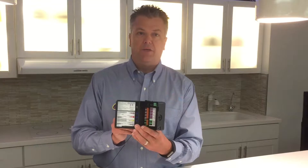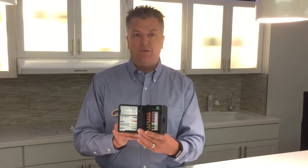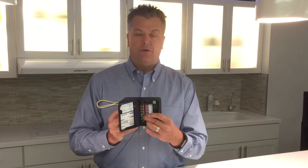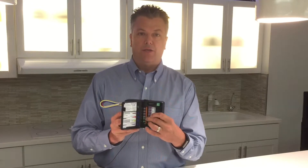The fourth relay can be tied to a different power supply. This allows you to control lights that may be fed from a different source, like under-counter or track lights, or it also allows you to control things like receptacles. In addition to the four relays, there are four zero-to-ten volt control channels which are used to dim either fluorescent or LED lights.